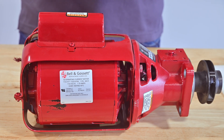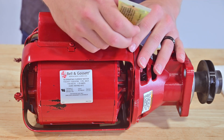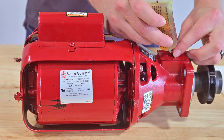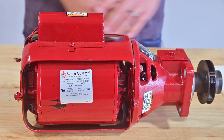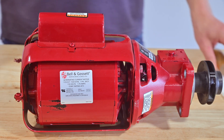For the motor, on startup we're going to add 12 drops to each side of the fill port, and for service we're going to add six to each. Avoid overfilling. For greaseable motors, make sure to run the motor while filling the grease, and securely replace the oil fill plug.